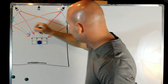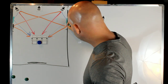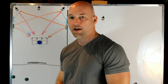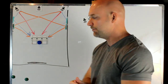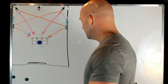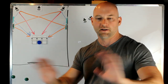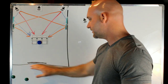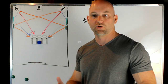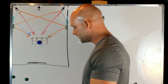On the rear wall, if you want to put a foot of insulation behind acoustic fabric, there's nothing wrong with that, but for a regular living room where you need it aesthetically pleasing and don't want to eat up all your space, we're going to put a couple of absorption panels right where these reflections are going to be. Let's go ahead and draw the reflections in.